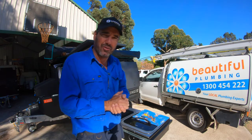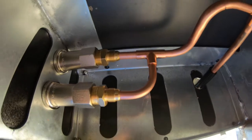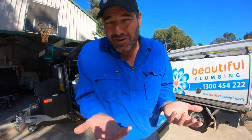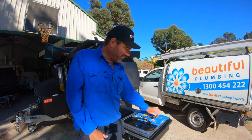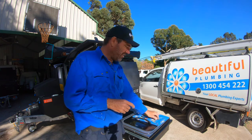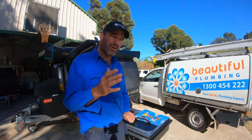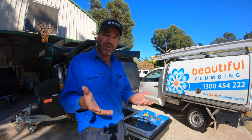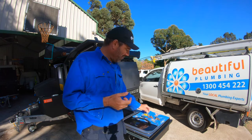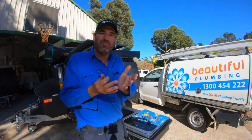The other joint is underneath the hot plate — you've got to have one there so you can disconnect it to service or replace it in the future. Sometimes you need flares, which is fine. But if I'd gone the all-flared option, I would have needed around 11 flared joints: three bayonets, two T-pieces at three joints each — that's nine — plus one for the regulator and one for the hot plate equals 11. By welding, it's brought that down to just two, which is so much better. It takes a bit more time and skill, but the result is far superior.